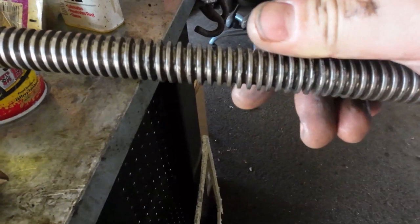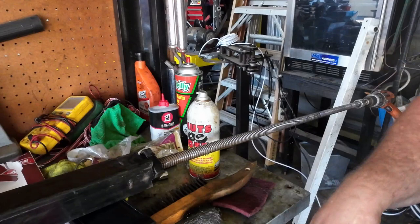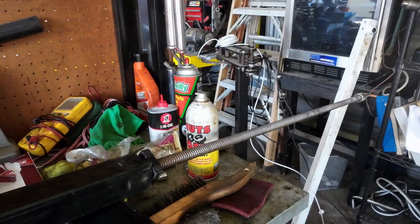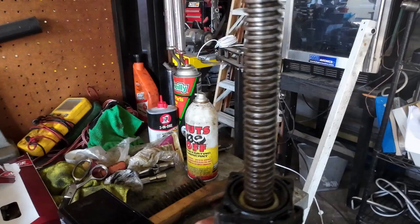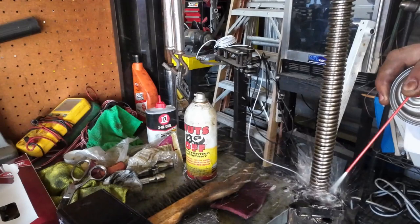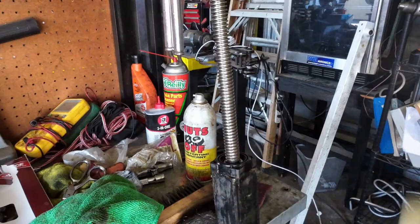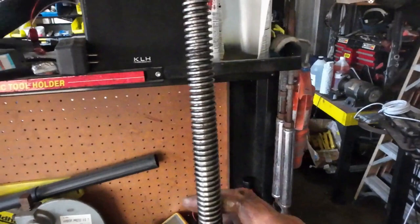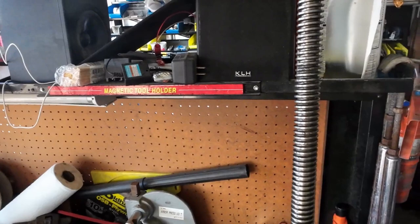Let's clean it off — take it all the way out and then we'll clean it and put a little bit of lube on. Take it out of here — I want it standing up. Whatever goes down into the foot I'm not too worried about, but we don't want all the gunk plugging it up. We'll shoot some more cleaner down in there and make sure this screw is dry. I'm going to let it sit for a couple minutes and let this cleaner evaporate off. Right here is where all that damage was — there's still a little bit, but it's going through that nut now without any problems.